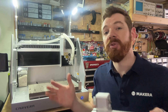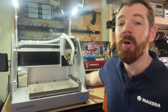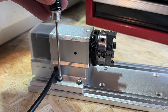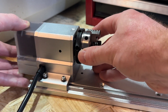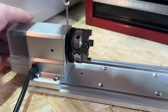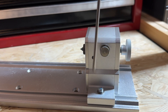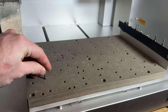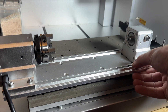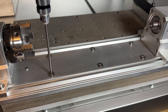It's now time to attach the 4th axis module. First, make sure the bed is clear with no clamps or spoil boards attached, and turn off your Carvera before attaching the module. Before installing, slide the headstock and spindle box into the correct position after unboxing — loosen but do not remove the four screws holding the headstock, slide it to align with the leftmost side of the base plate, then tighten the four screws. You may also loosen the two screws on the tailstock so it can slide along the base for easier installation. Next, install two dowel pins in the preset holes towards the front of the bed, then carefully lower and align the module with these pins, ensuring the plug is not caught between the module and the bed. Secure the module using six M5 by 20 screws.